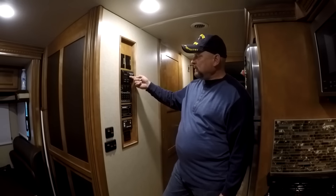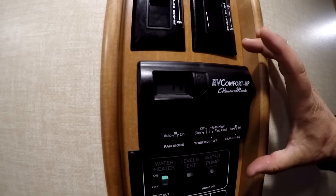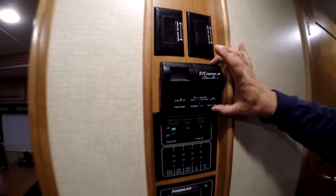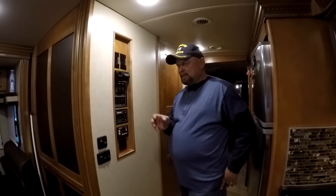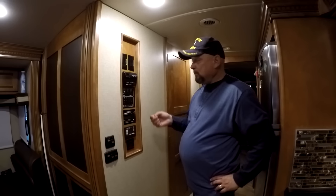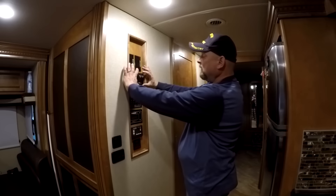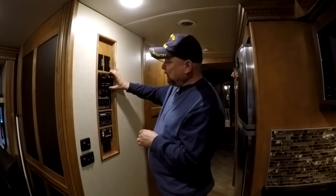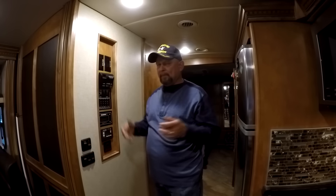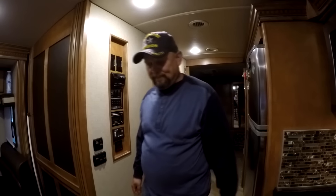Here's what I did that seems to have fixed it for us — maybe it'll fix it for you as well. I took the thermostat off the wall, I put insulation in the hole, then I cut a piece of Reflectix — that silver bubble-wrap insulation — to fit behind the thermostat, put a little hole through it, put all the wires through the little hole, and remounted the thermostat with that behind it. And it seems to have helped us a lot. Maybe it'll help you also. Hope it does. Thank you.